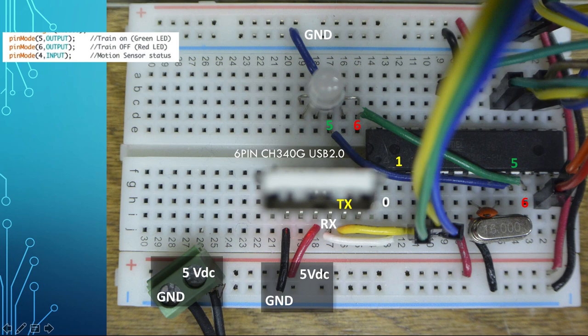The LED doesn't go directly — it goes through a node with a 110-ohm resistor under the RGB LED. You're supposed to use 220-ohm resistors with LEDs in a 5-volt environment to prevent burning them. To be honest, I like the LEDs bright, so I somewhat skip the resistors.